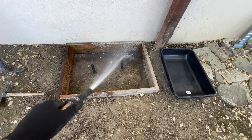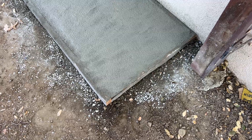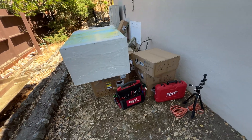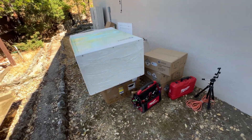Because the battery modules are heavy, we're going to pour a concrete pad for the battery cabinet. We're using 2x8 lumber for formwork and we used about 14 bags of concrete, 50 pounds each bag. Here is the equipment we're going to mount: the Solark 15K. We have a stack rack cabinet for 6 batteries and we're going to install 3 batteries for now.